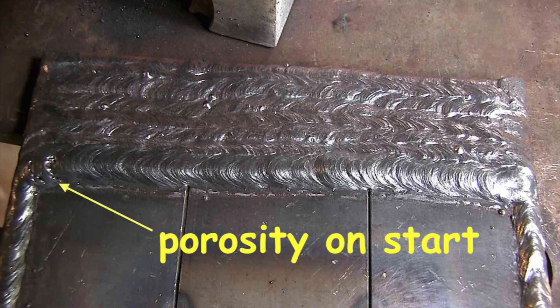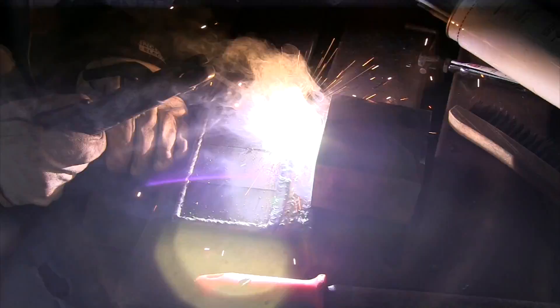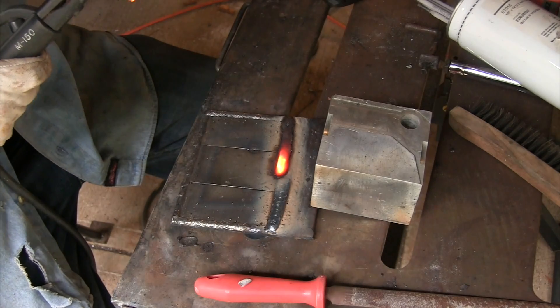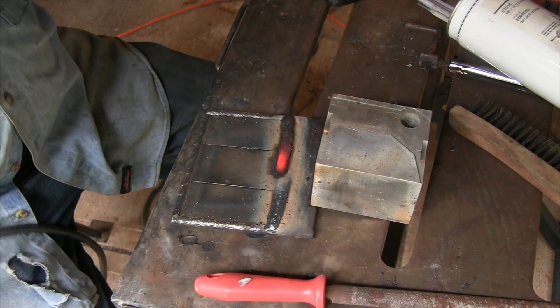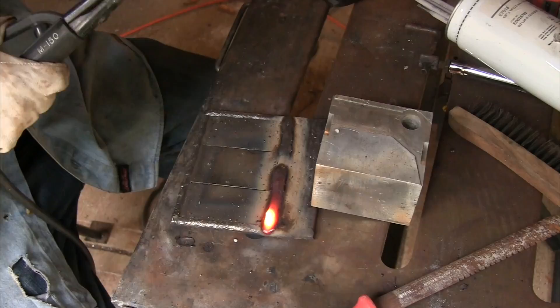These rods were not kept in an oven — that can also happen from long arcing on a start. I had a fan blowing pretty hard to get rid of smoke. But for practice purposes, whether the rod's in an oven or not, it'll serve the purpose. You want to stack each bead roughly halfway over the previous bead, or not quite halfway, but pretty close. The idea is to stack them uniformly so there are no valleys and no humps.